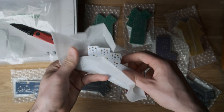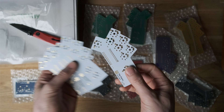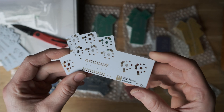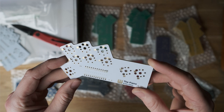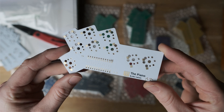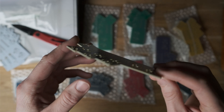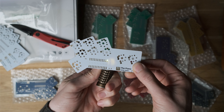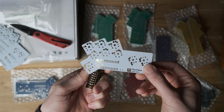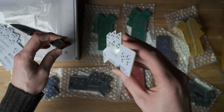This is the white board — quite a cool white — and we've got the gold ENIG surface finish on the copper layer, which just looks lovely, a really nice finish. You can see just how reflective it is; being white the reflection looks a little lower than on darker boards, but it is still very glossy and you can see it catching the light. If I shine a torch through, you can see this is actually one of the more opaque solder masks — only just seeing light shine through — which means this isn't a good color for that copper-reveal artwork treatment.